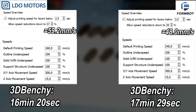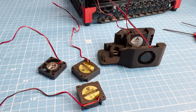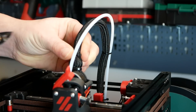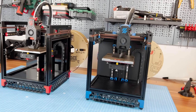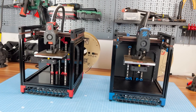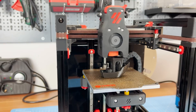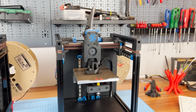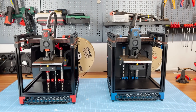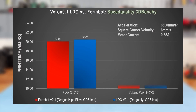The LDO kit is slightly faster in this scenario — again, it's the bottleneck concerning part cooling. As it is a cheap and quite easy fix for the FormBot kit, I equaled the part cooling fans on both. At that moment, I was very happy that I chose an open cable sleeve for the tool head wiring over the closed one included with the FormBot kit. Now that the part cooling performance is equal on both kits, we can focus on extrusion flow and therefore sheer printing speed differences. And there it is — a slight advantage for HiFlow.